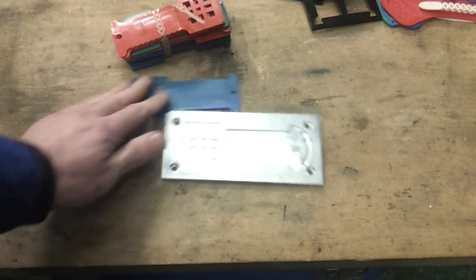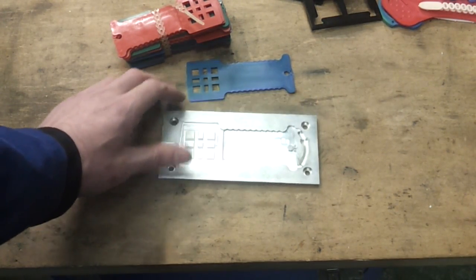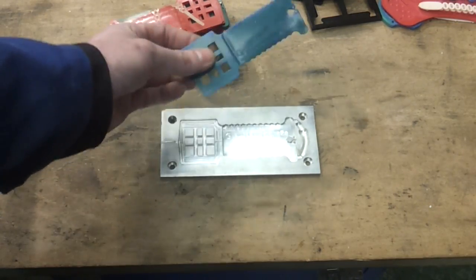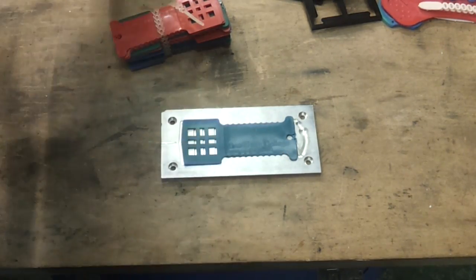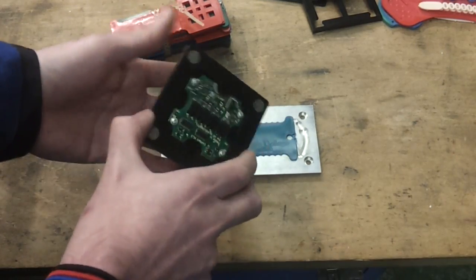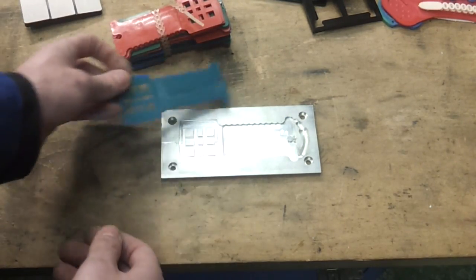That's the sort of thing you can do with very modest equipment. If you don't have access to a moulding machine, you can always find a local firm that might help you out — you're typically looking at 25 to 30 quid an hour for a small machine. The bulk of the work is just learning how to use a CNC system, and there are plenty of videos out there showing you how to do that. I'm really going to focus on explaining how you design the moulds and get from an idea to a physical product. If it's something you're trying to commercialise, you don't need to gild the lily to begin with — you can do that once you've got the gold. All you really need to do is get to something that is good enough, fit for purpose. You can do a slightly better quality mould via the industrial route, but if you've got something that's good enough to get your product out there, you can prove you've got a market, make some money, and then feed that back into getting a professional mould done with ejector systems and all the rest of it. But to get started, you just need a bit of aluminium.